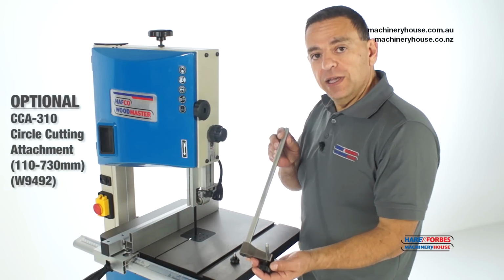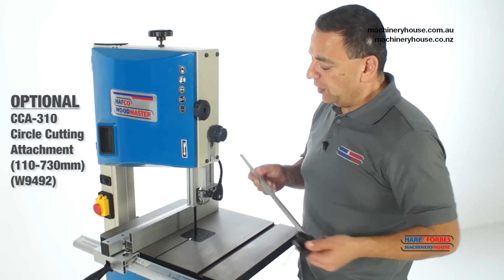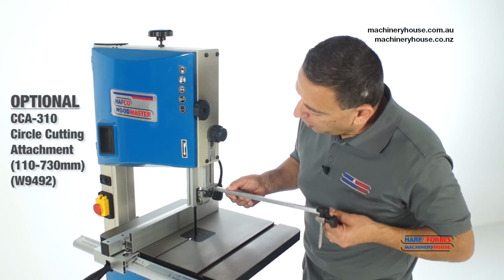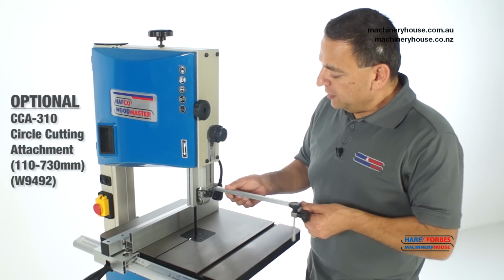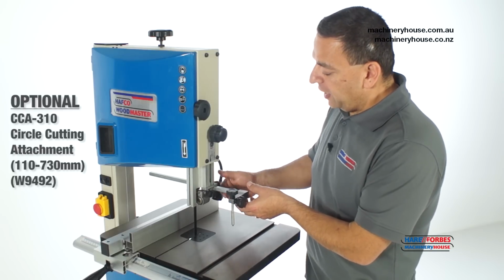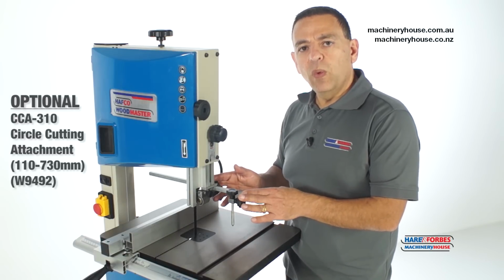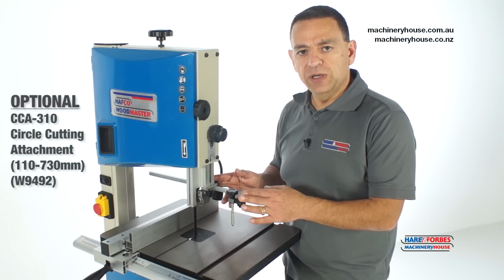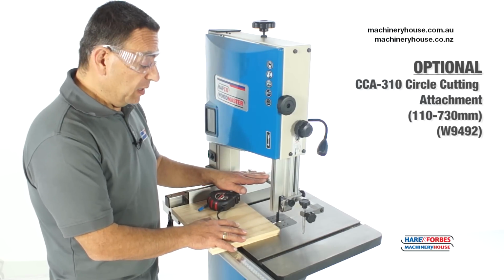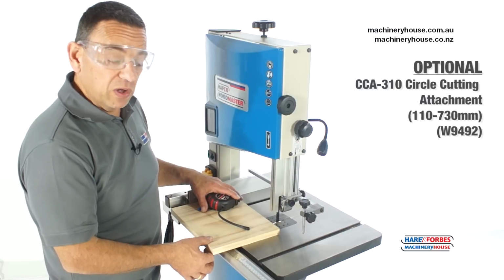Now there's an optional extra you can buy for this machine. It's a circle cutting attachment, which consists of these items, and it's simply used by sliding into this existing bracket at the back here, which holds the attachment, like so, and placing the locking nut in, and this can be adjusted for centers and allows you to cut circles from 110 to 730 millimeters. So let's demonstrate this optional circle cutting attachment by cutting a 200mm circle in this 20mm pine.